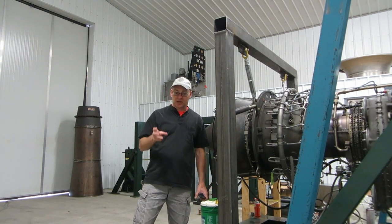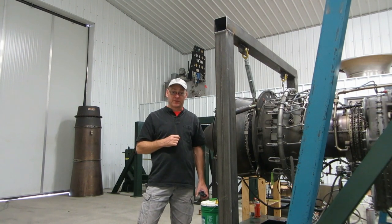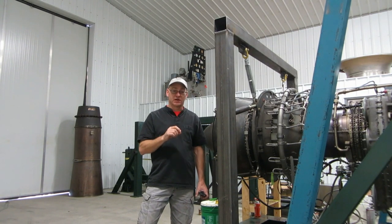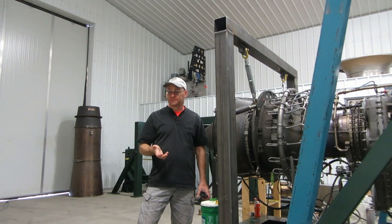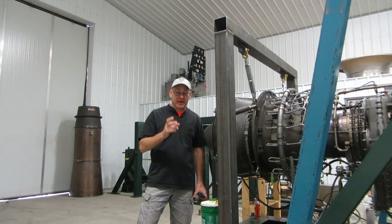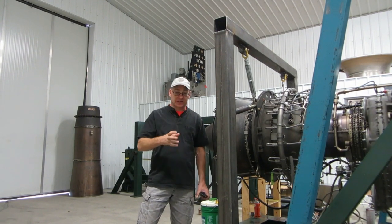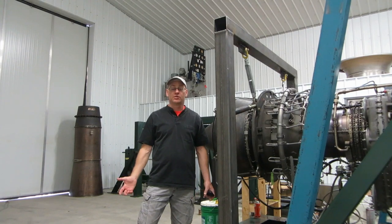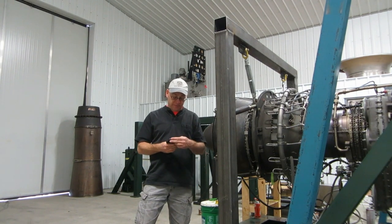So for things like vehicles, trucks, and pleasure boats, gas turbines really don't make a whole lot of sense. And yes, they are noisy. Keep in mind cruise ships often have a smaller piston engine and then a very large gas turbine to get up to high speed — 20 knots or whatever. That engine is virtually silent because there's a massive volume inside the ship devoted to inlet air baffling, silencing, and exhaust silencing. So when you're on a cruise ship, you can't hear the engine. Great question by Roger Mason.